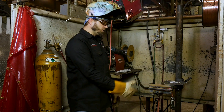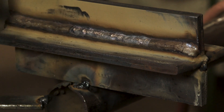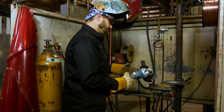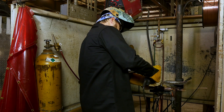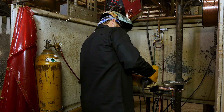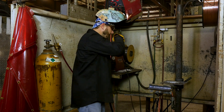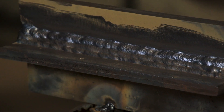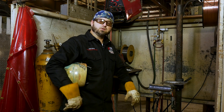And this is how you run a 2F — six beads or more — 7018 fillet weld. I'll clean this up so you can see it really nice. You have a nice 2F fillet weld. 7018, about 110 amps, and with a little time and practice, you can run it the same.